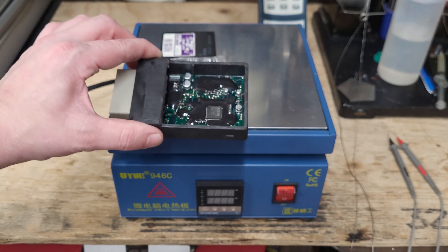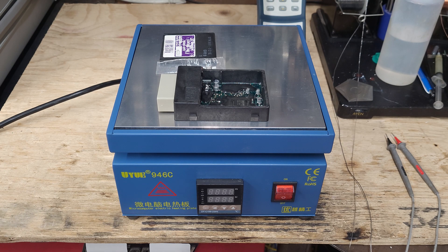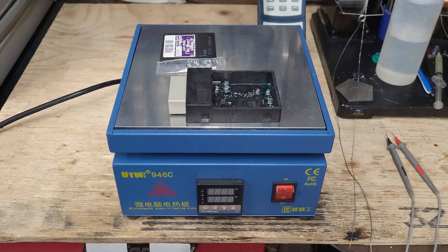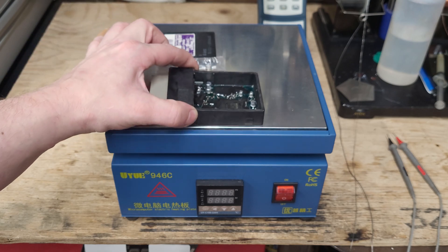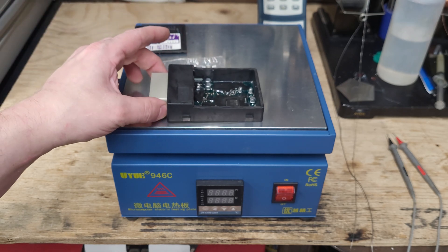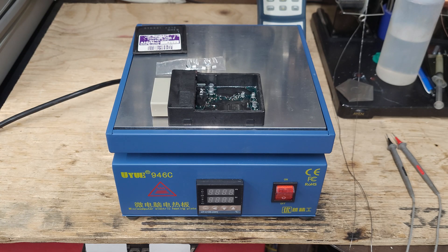I replaced all five capacitors. It took a little longer than normal — we had to order the capacitors. It turned out to be an aluminum nitride ceramic circuit board, so my little preheater worked itself to death trying to heat it up and went in the trash bin. I had to order another preheater. The plastic housing starts to soften around 150–160°C, so you want to preheat the board to about 130°C.